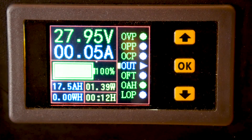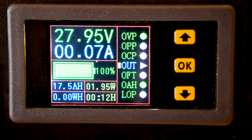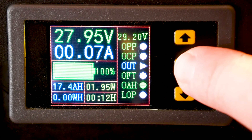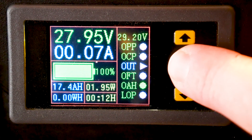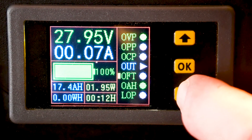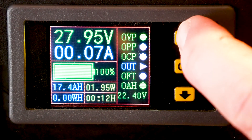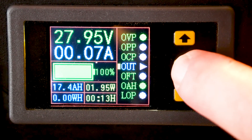Taking a look at the meter on the left front of the power box — this is a shunt system that offers similar protective features found in the boost-buck voltage regulator. I'm currently using the over and under voltage protective features, and I have set the battery amp hours to 17.5, which is the true rating of this 7S7P battery. Amp hours and battery state of charge do decrease with power usage as stated on the display. I do find it curious that after charging the battery, I have to manually reset the meter and amp hours. These meters can fall short on ease of use and accuracy, but you actually get a lot for the little amount of money you're paying for these types of devices.